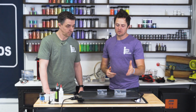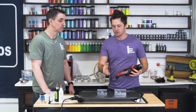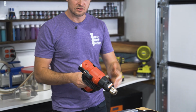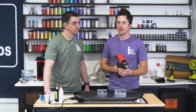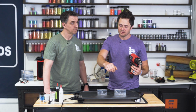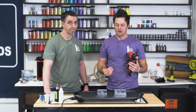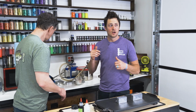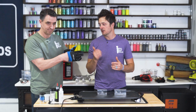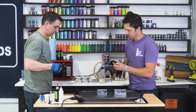Yeah. Another way to do this, if you don't have this griddle, when I'm testing molds, I actually heat them up with this heat gun. I just get this set to maximum heat, blow it on there until it's hot to the touch, and then I pour the plastic in there. So you want this hot because, again, you're avoiding cold cracking as the metal pulls a lot of heat out of the plastic. Now, also, this is a good time, before he pulls that out, we're gonna get our protective equipment on, the gloves, the glasses, and I'm doing that too because I'm back here too.